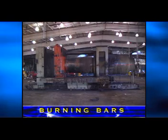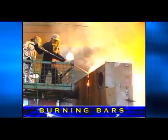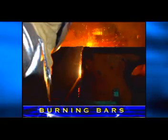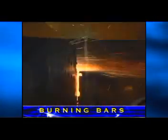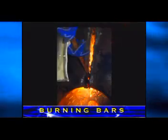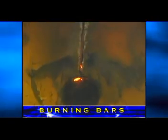This contractor is performing a demolition project that involves a large injection mold machine. The material the operator is cutting is 26-inch thick steel. To efficiently cut this material required a 1.05-inch burning bar. The oxygen flow rate to make this cut was 80 to 90 cubic feet per minute at 150 PSI. The cutting rate for the 26-inch thick material was 1.5 inches per minute.